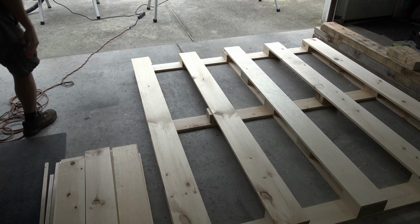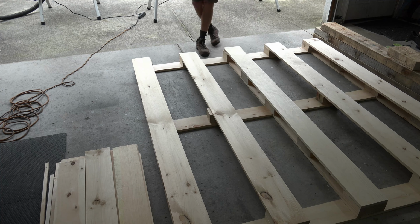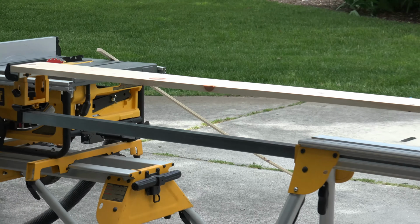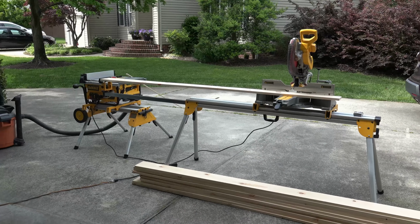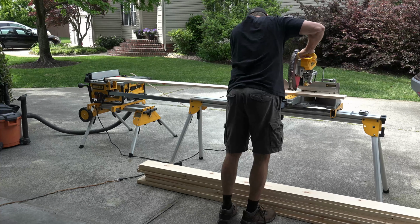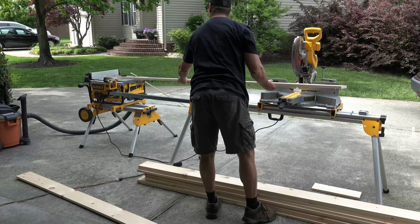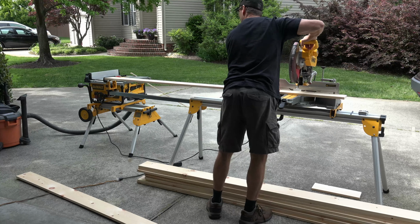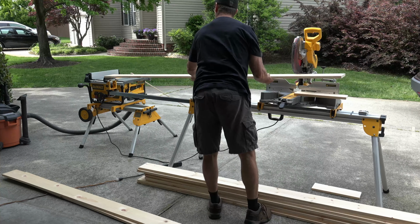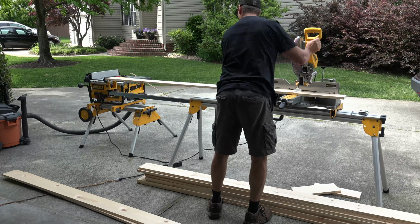Now that those are cut, you can start mass producing the crossboards. If you recall, that measurement was supposed to be 80 inches. Start by cutting 10 pieces to see where that puts you. The gaps you intend to leave might differ from my taste, but my gaps will be the same width as the side of these boards. In other words, if you put a board on its side, it will fit in the gaps I intend to make. I set my cheater stops on my miter saw stand and rapidly produce 80-inch cut boards.